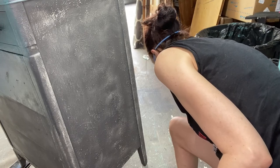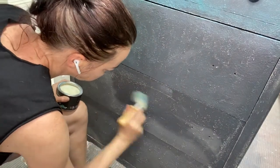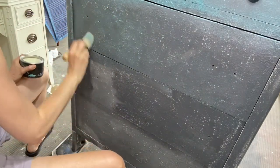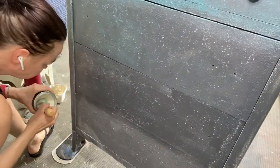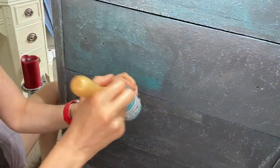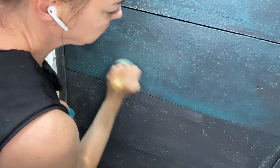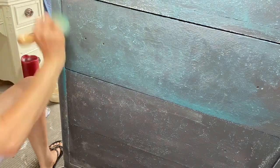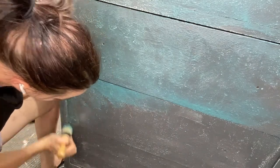Time to seal. I've got my DIY clear wax and I am using a wax brush, just really working it into all of the textured goodness. On the top drawer I had already sealed that one and started playing with some of the Shipwrecked Wax to see if that's the way I wanted to go. So I grab my Shipwrecked and I'm blending that all over the entire piece. I like to start with the clear wax when I'm doing a white wax, a dark wax, or this turquoise-teal wax, because it helps you have more control — you can take things on and off a little bit easier when you have the clear wax as a sort of a base.